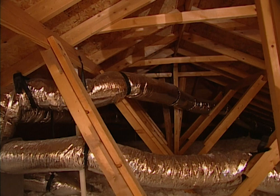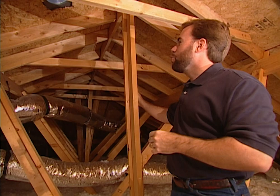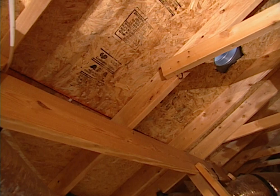There's a lot you can learn about your house up in the attic. First, check your rafters — make sure everything's straight, everything's nailed together, and they didn't use any old lumber or cut a big chunk out of a piece. This is the support that ties your whole house together. Also look around your roof and see if you see daylight anywhere. You should not be able to see daylight — if you do, that's a place where water is going to get inside. Check for any old rotted-out wood, because that's a sign water is already leaking into the home.